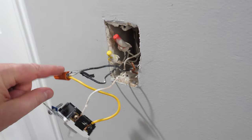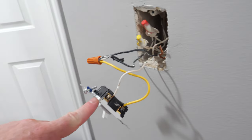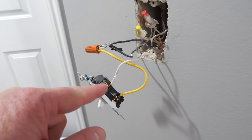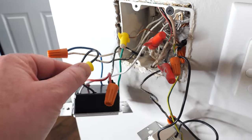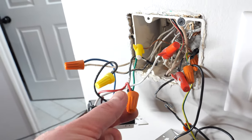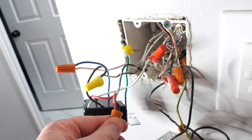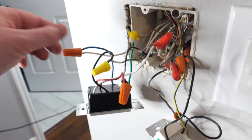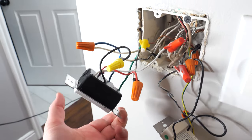The wiring at the mechanical switch has the line coming in connecting to the jumper and the black traveler wire, all connected to the common. The white jumper wire goes to the other side — no ground or neutral on that side. Over at the Claro, the black traveler cable connects to the black on the box, ground connects to ground, load connects to the red, the white traveler connects to the blue, and the white connects to the neutral. That is how it should work. So now let's go ahead and try the Diva switch and see if it's as simple.